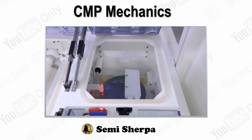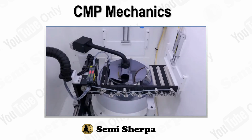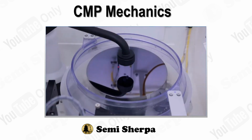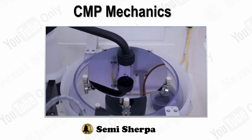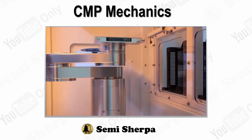We'll also touch on other critical components such as the pad conditioner, the groove patterns on the CMP pad, and the polishing platen. In the third segment, we'll move on to the CMP cleaner module, where we'll explain how cleaners like megasonic cleaners, brush cleaners, and two-fluid jet cleaners work. We'll also introduce the Marangoni effect, which plays a key role in the drying process.